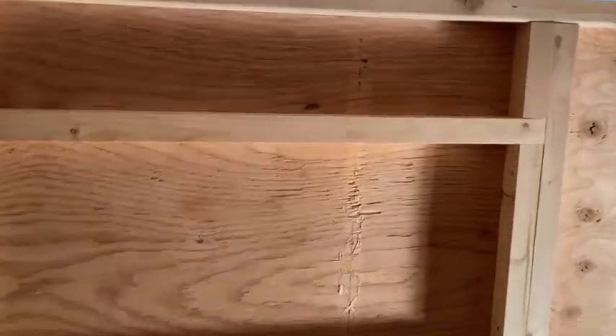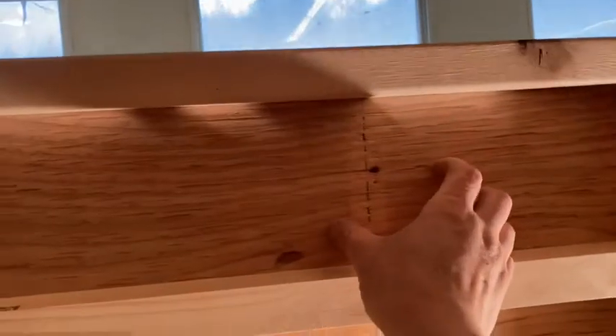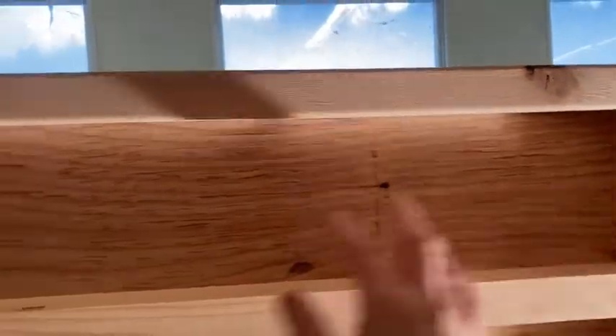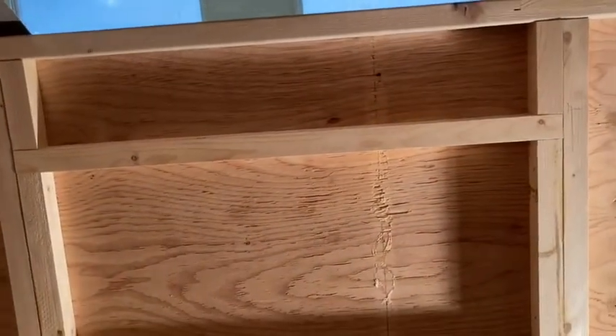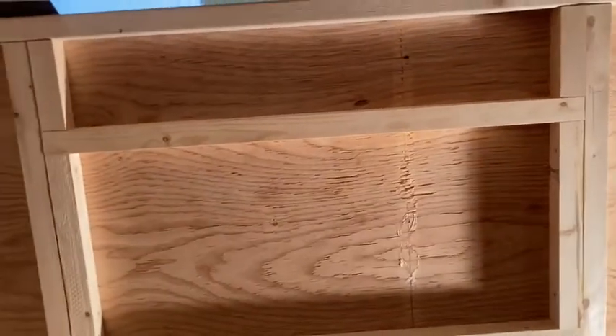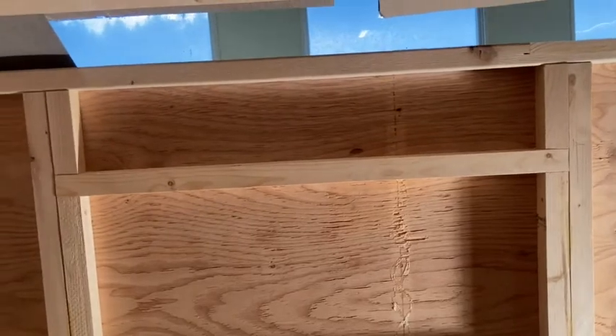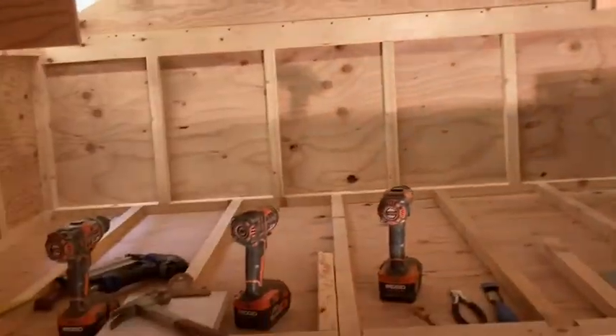I had left the original piece — if you watched my last video — and then I'd added a little spacer block. It looks kind of funny; there's gonna be two little weird pieces of insulation that didn't add any real structural benefit. When I put my window frame on the outside, I cut a little angled bevel to keep water out. That'll give a little extra meat to hit. So that is what I'm going to cut next — these pieces of plywood — and then I've got to cut some framing members for the rest of my windows.